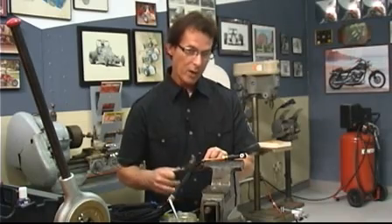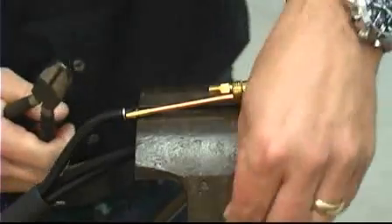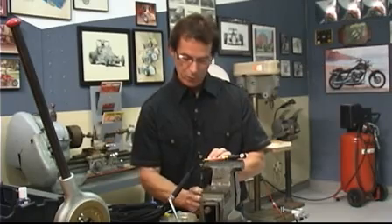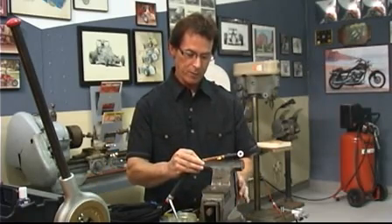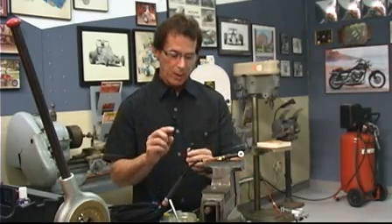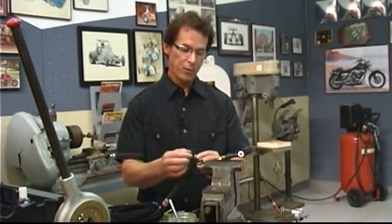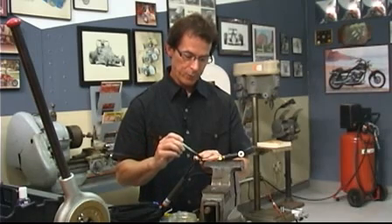Use some side cutters to cut the wire tie, leaving about an eighth of an inch sticking up. Then take the body of the pliers and fold the wire tie over. Loosen the vise, rotate the body, and move on to installing the gas tube. On most TIG torches, the gas and water hoses are different sizes, which keeps you from crossing those connections.